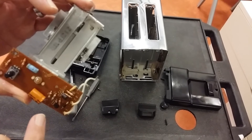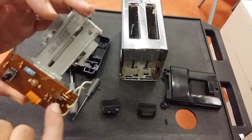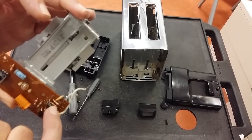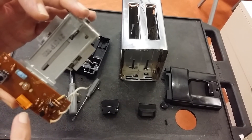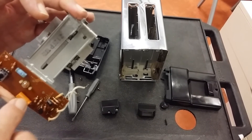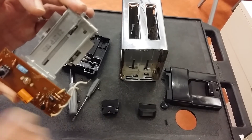What happens is that when the transistor is turned on, it's like pressing the flush — it sends just a little pulse onto the gate of this thyristor, and that will suddenly allow the current from this capacitor, which is stored as a charge inside, to just whoosh out.